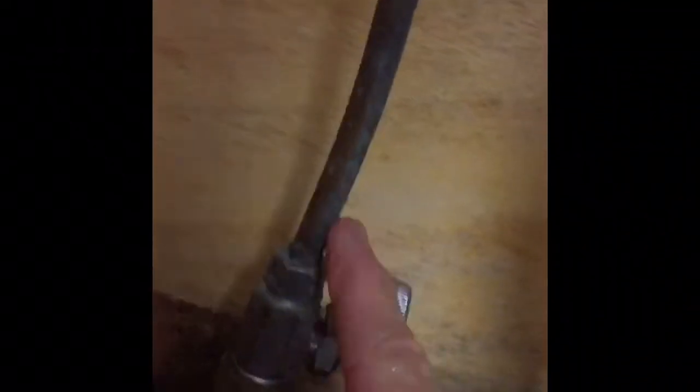And this one has 3 on here. I'll turn them all off just to be sure. This one here feeds a water fountain that they've put in on top. Sometimes these things don't hold, so hopefully they will. So what I gotta do is, this is the supply line for the cold, supply line for the hot, so I gotta take them loose here and here.